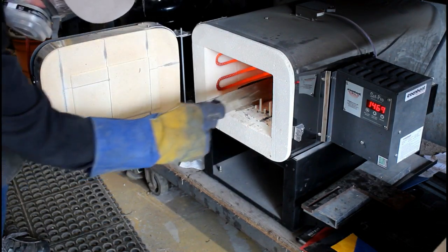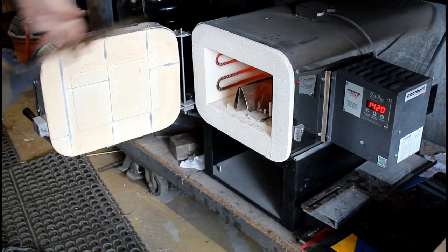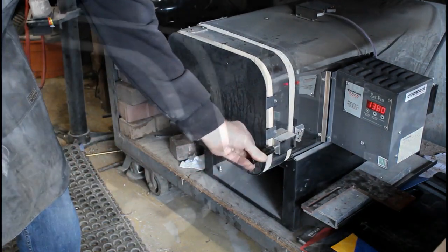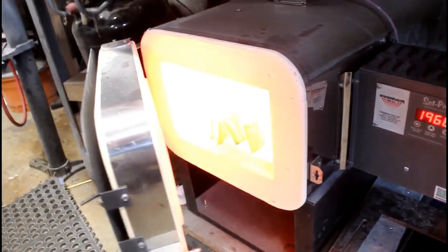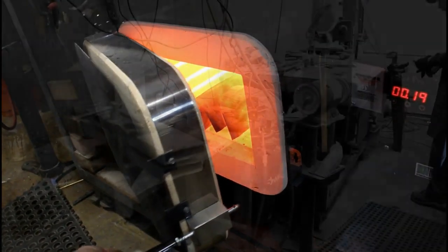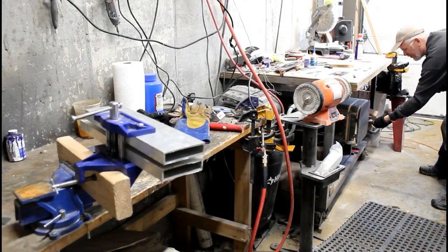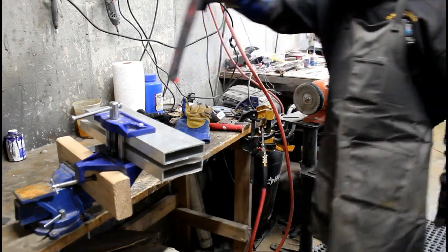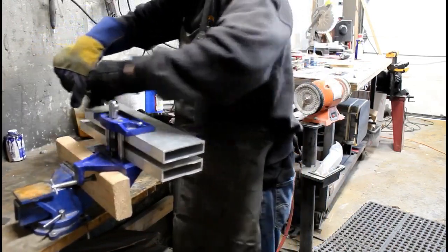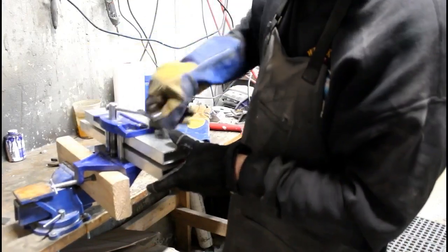I like to do these in batches, so I'll put a batch of stainless blanks — all with the rough grinds on the bevels done and all wrapped in tool wrap — into my Even Heat oven, get it up to temperature, hold it at that temperature for 15 minutes. Then I'm going to plate quench these. I've got aluminum — you can use solid aluminum, I happen to use rectangular aluminum tubing. I clamp these right out of the oven between two plates and clamp them closed. You don't want that stainless to be able to twist or warp at all during the cooling process.